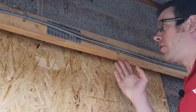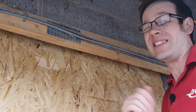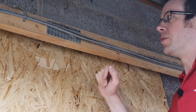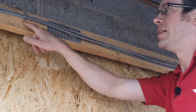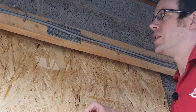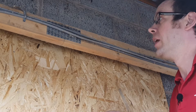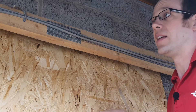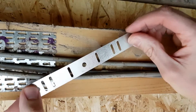Now we come to the thorny issue of the existing cables. I've gone to quite a bit of trouble to make sure my new cable won't collapse prematurely in a fire, but there are a lot of existing cables here that could cause trouble. They've been fixed with scraps of 1mm twin and CPC looped over and hammered in place — I'm not convinced that will give an effective fixing in a fire situation. We could debate whether regulations are retrospective, but I've decided to spend a little extra time making sure the existing cables are not going to collapse prematurely — mainly because I enjoy sleeping at night.